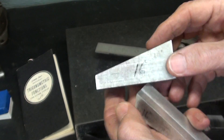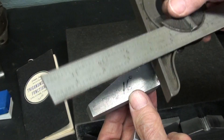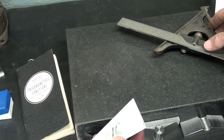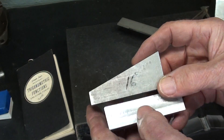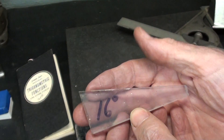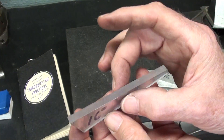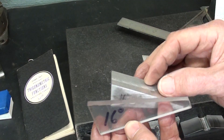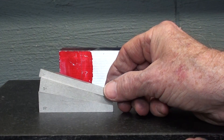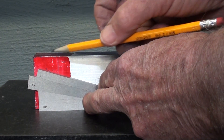I made 16-degree angle blocks — two of them out of three-quarter aluminum. They can be made very quickly just with a protractor, and that is semi-accurate as long as you've got a square corner. I'll show you a couple other ways to do it with these angle blocks and with a sine bar that would be even more accurate. You could also make one out of plastic or wood with a band saw and a belt sander in just a few minutes, and they're better if they're thicker rather than thin. You could also use commercially made blocks to scribe the line — it would be super accurate, though they tend to slide around.